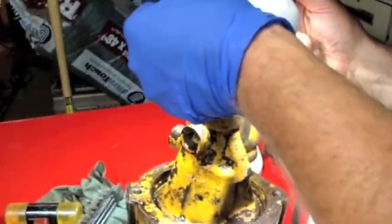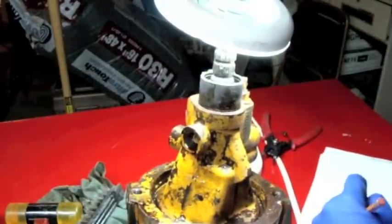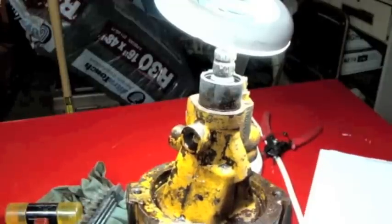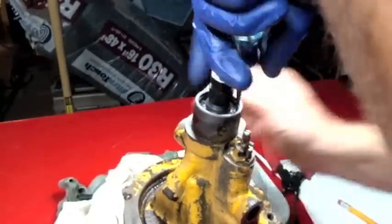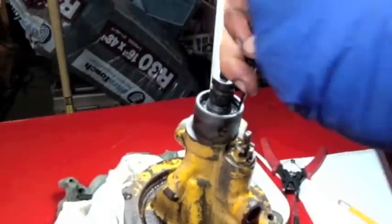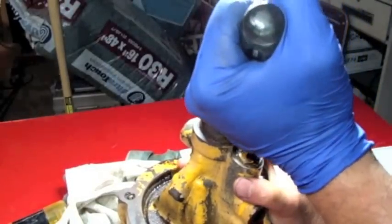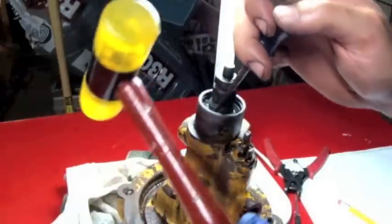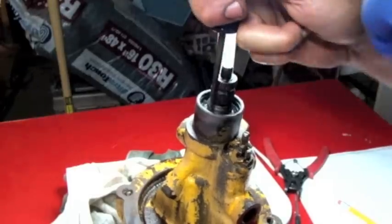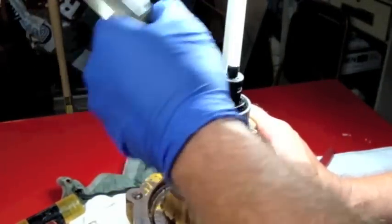After another space there's also the number 133. So we'll call this seal number two and the top one seal number one. The second seal isn't coming out as easily as the first — my awl keeps slipping between the lip and the shaft. With a bit more effort I was finally able to poke through. This one is more of a conventional seal — it's got the metal frame and probably a concave area on the bottom side.